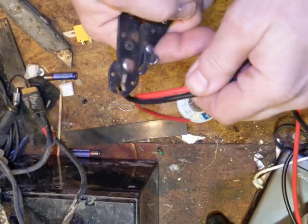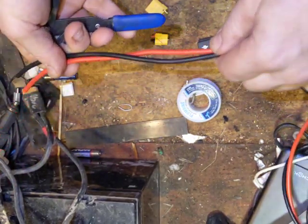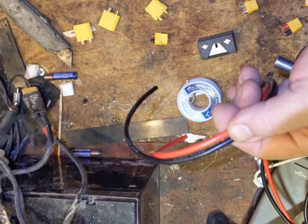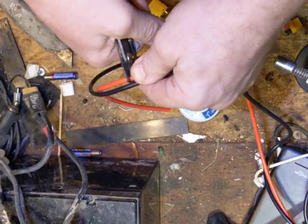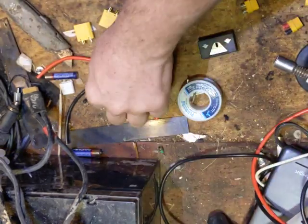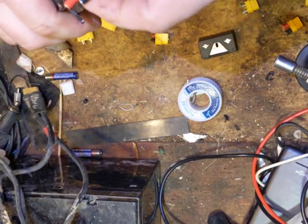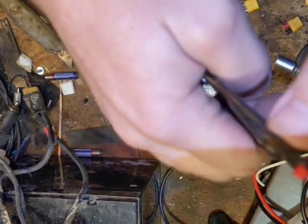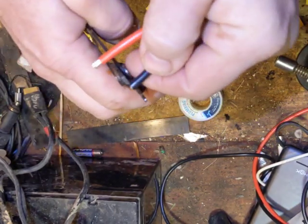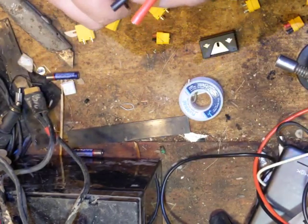This process is going to go kind of slow, so run it at 1.5x if you find me too slow. It doesn't need to be very long — it's not an extension cord for our 12 volt DC applications. See how much I'm taking off? It's not very much. Don't take off too much — it's very fine stranded. Just take off a little bit from either end.